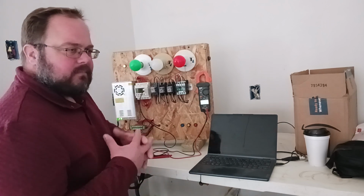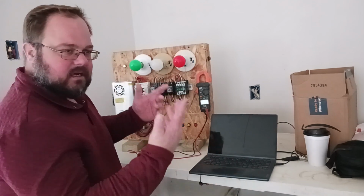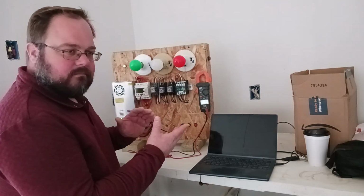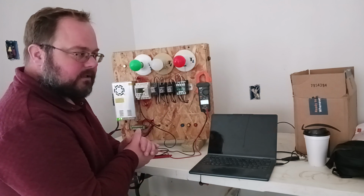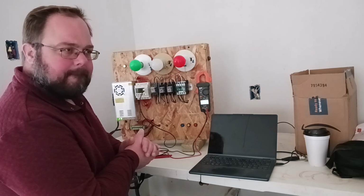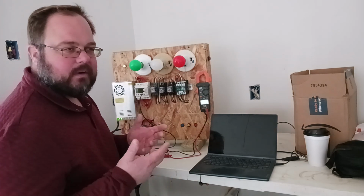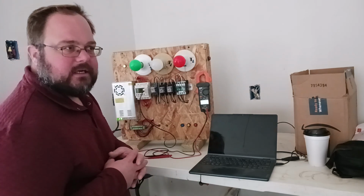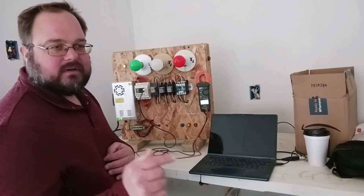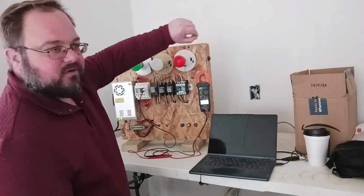So sometimes you can get a copy of the plans, and the plans will show, hey, this sensor goes to this input, this contactor goes to this output, and the ladder diagrams can help you to learn to troubleshoot. But sometimes in the PLC there might be a more complicated program, like there might be different settings. I'm going to throw out a technical jargon, a data register, which we'll talk about later. A data register may be used. That means basically the operator may be able to put different settings on maybe a counter. So maybe you have to trip an input several times to get an output.